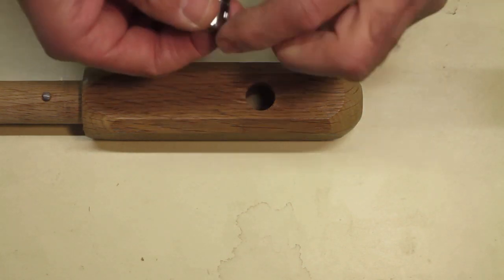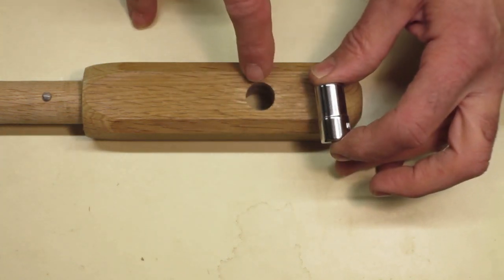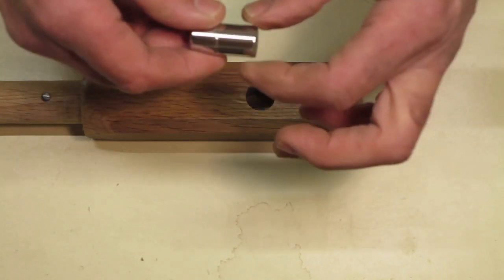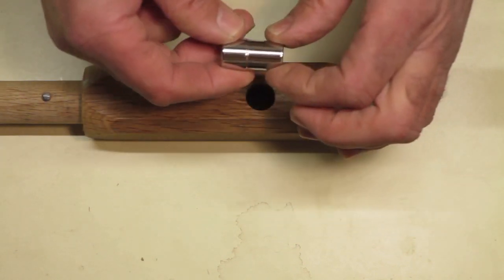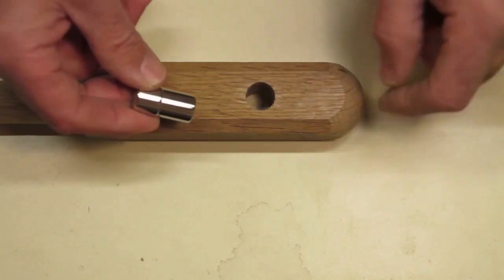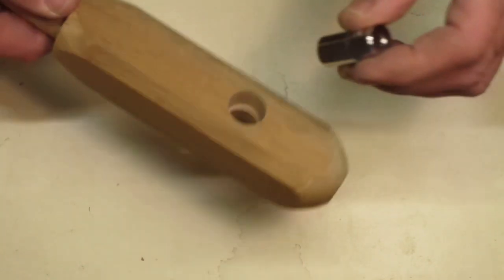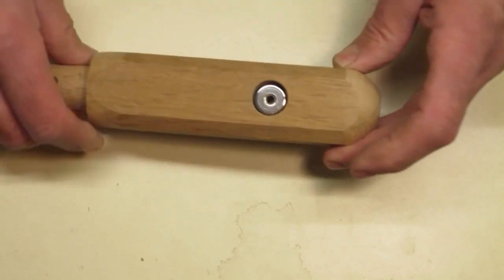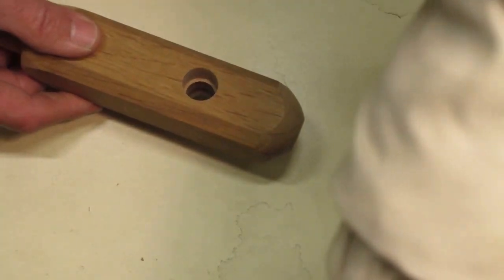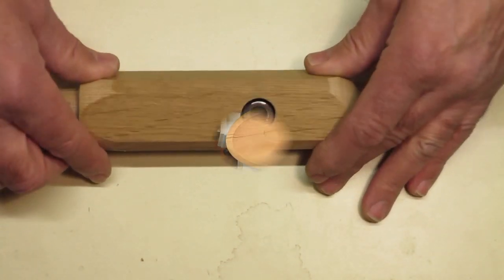Now on these little inserts here, there's a little lip there, so I've drilled with the Forstner bit a hole straight through at that dimension, and the reason I'm not giving you the dimensions is purely and simply, if you have a set of these, they'll have different dimensions. And then I've merely cut a slightly larger hole which stops it falling through. Turn it over and that'll be better. Stops it falling through. Okay, so you can alter whatever size guide you want to put in there for whatever hole you want to drill, and as I say, it won't fall through.